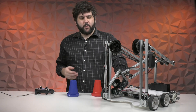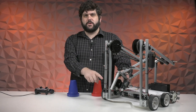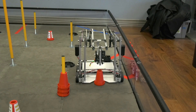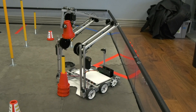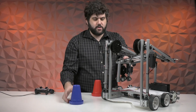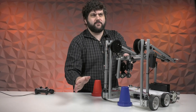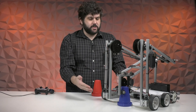For the intake, we used the standard servo one-sided intake that we featured in one of our other intake videos. This one is pretty simple — it just comes straight down on the cones, picks them up, grabs them, and then it's in the grip. We also have a cutout here in the base plate so that you can just drive and these cones will self-center as your drivetrain moves, which makes picking up a much easier task.